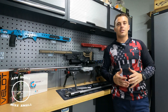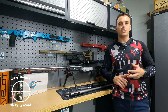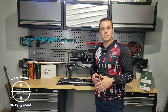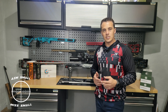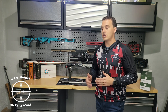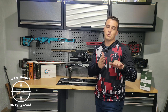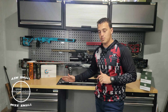There you have it guys — action blueprinting or truing: what it is, what the advantages are, and the process that Eagle Barrels actually does to achieve the blueprinting. I'll put Eagle Barrels' contact details in the description below. It's not a lengthy process but you do get the accuracy. One tip: if you haven't done it and you want to do it, be aware that you will have to redo a ladder test because your allowable case length and everything changes since they cut the bolt face as well as the barrel.